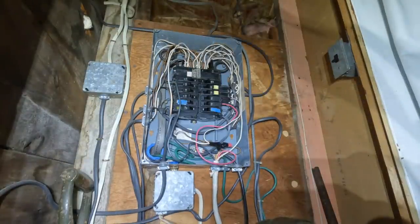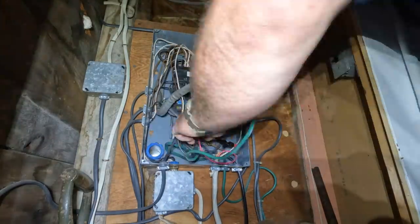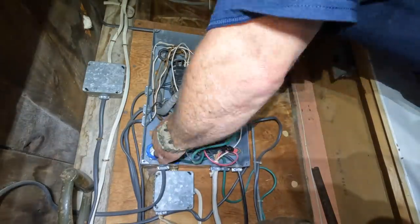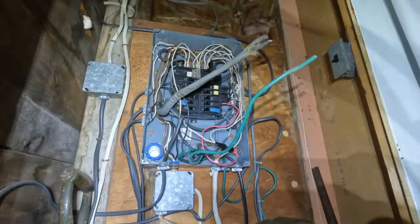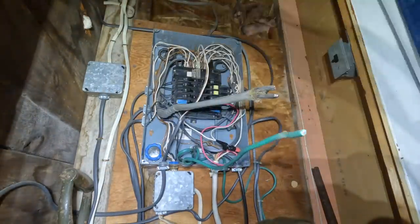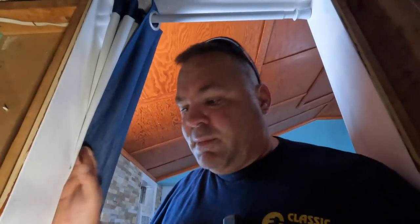So what I'm doing here specifically before I go back outside to finish up on the outside is just removing that service entrance cable and the nipple that goes between the panel and the meter enclosure on the outside. And as you'll see, it's kind of a pain in the neck to cut that steel nipple, but I eventually get it so I can finish up on the outside. All right, so right now I'm having a difficult time getting that nipple out from the meter to the back of the panel here. It's just giving me a hard time. So I'm going to have to Sawzall out the other side so I get that nipple out of the way